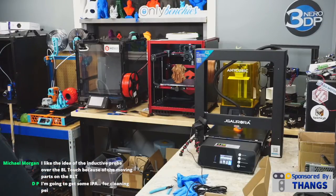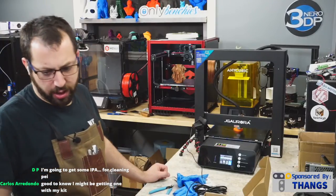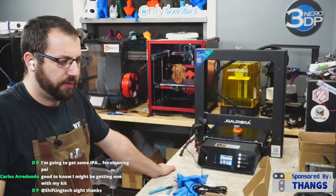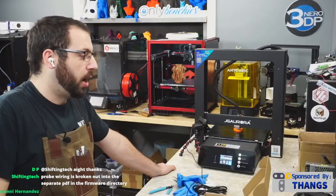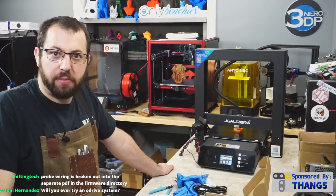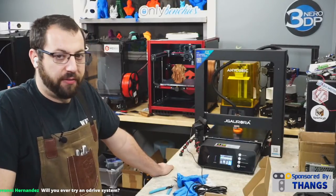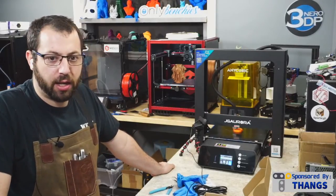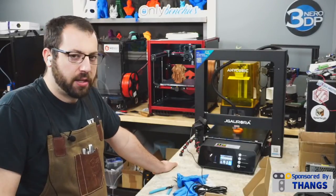So yes, you don't need the BAT85 diode with the Spider. I don't know about the Octopus though. I have to look into that still. Because with the Spider board, FYSETC contacted the Voron Design team, said, hey, we want to make a board basically specifically for the V2. Is that okay? They sent over a few development units to some of the guys on the team who do have PCB design experience, and they went over the board, tested it, provided some feedback. Hey, can you guys put a 5-volt power supply on it that can power a full-size Raspberry Pi? That would be sweet. They did. Can you make sure that it can take an inductive probe? You don't need a BAT85. They made that. So they took some suggestions from the team, and then they put out the board.